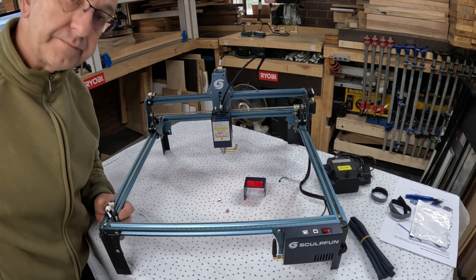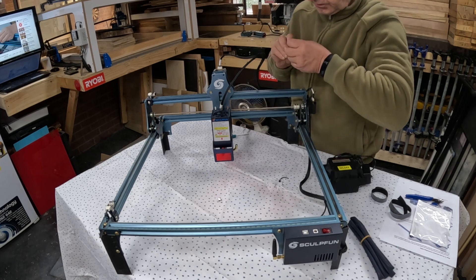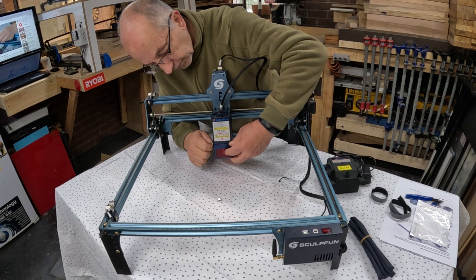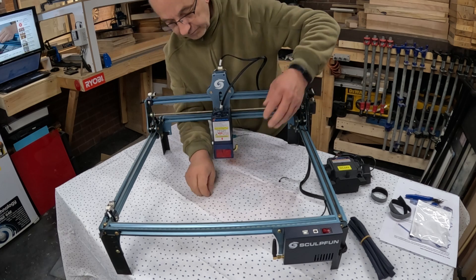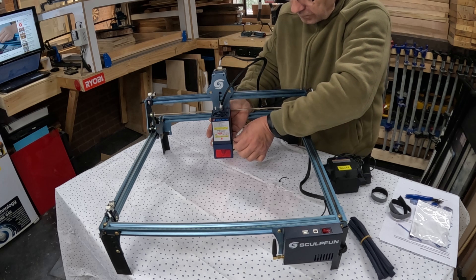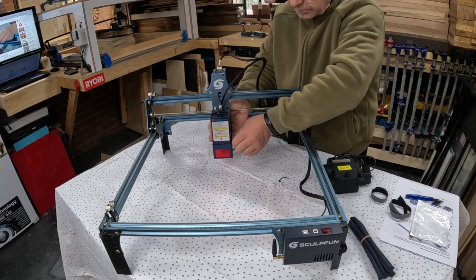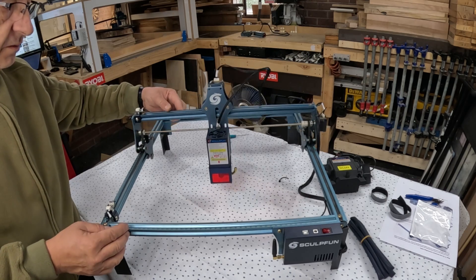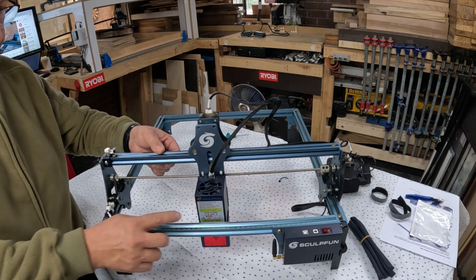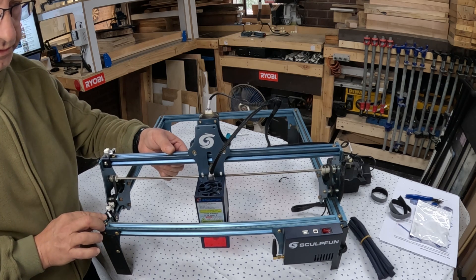There you go. One thing I forgot to do was fit the shield to the laser — most important — so you don't blind yourself. Let's just double-check. As you can see, there is very little tolerance, so make sure you get this on 16mm. If anything, you can push it a fraction further forward just to be on the safe side.